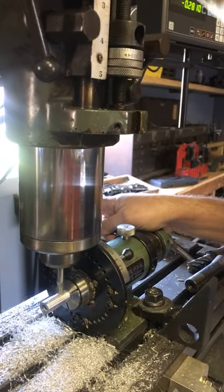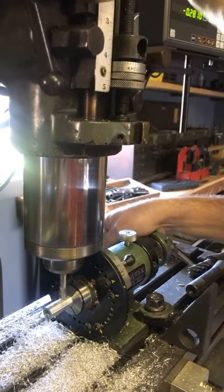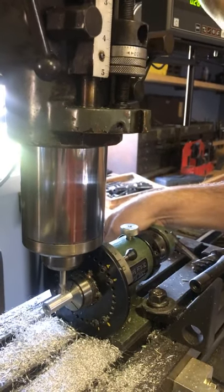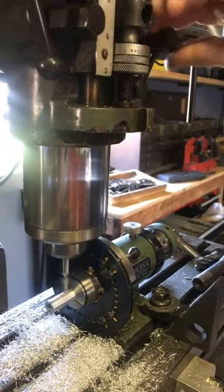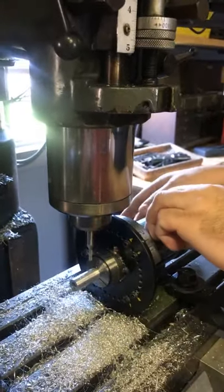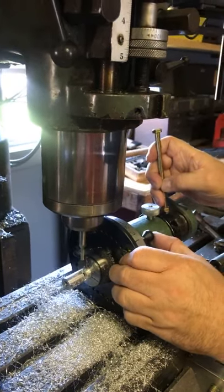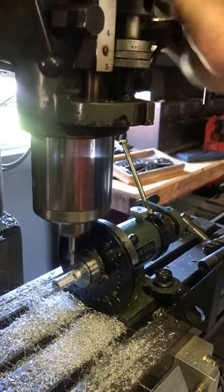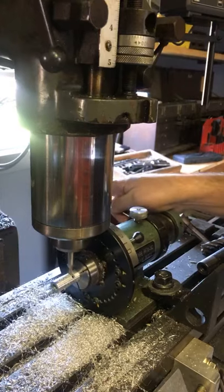I have it set up so that when that pin touches my table, it's exactly 90 degrees from where I started, and my secondary pin locations will line up in the corresponding holes on my 5C spin fixture. That hole lines up perfect. Now I need to go back and make sure that my slot is smooth — I'll lower my plunger and once again I'm rolling that slot.